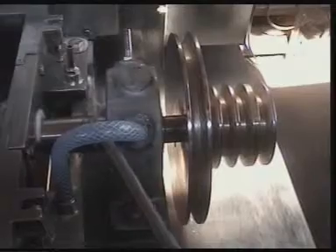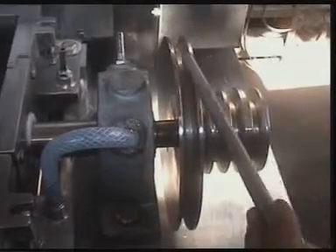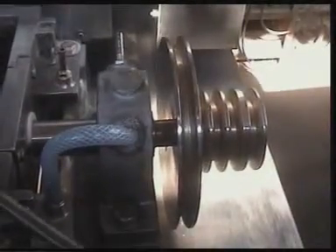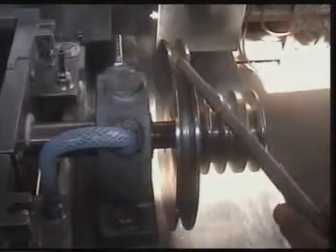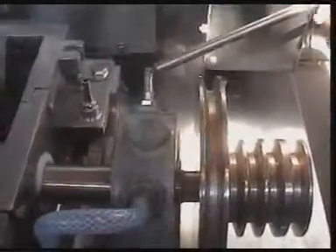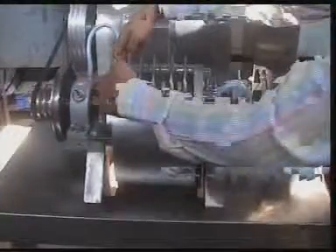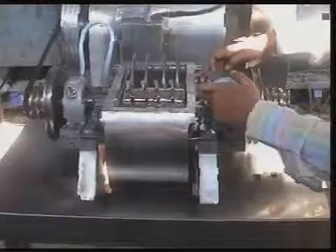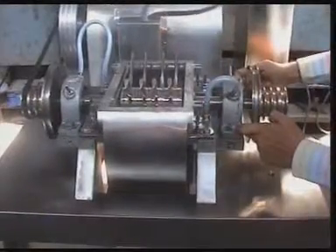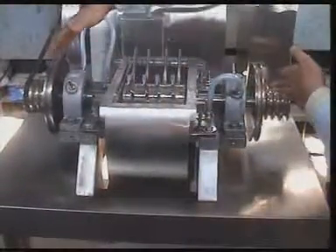This is the pillow block number 2 and this is the pulley, which remains idle when the machine is running. But it is helpful when we change the position of these beaters from knife to impact — you don't need to change the pulley, you have to simply rotate the whole assembly. This is the outlet of the main water jacketing. You have to loosen these four bolts of the whole assembly and rotate the whole assembly in a simple manner.